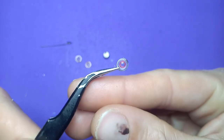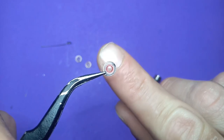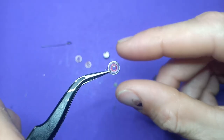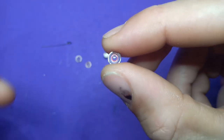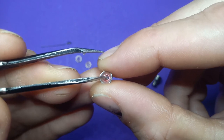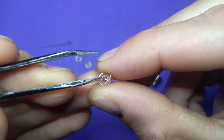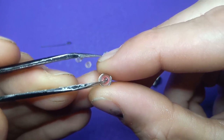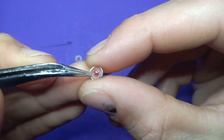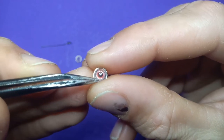So this is a liquid silicone driver. And now this is uber transparent. I don't really know how to show you guys, but it is much clearer than the other two. And it's really stiff. When you look at it, it's almost like a lens. This diaphragm is really hard to deform, like it almost pops. Now, the coating around it is polyurethane. So this is PU. So this would be liquid silicone plus PU, or polyurethane, for the surround ring.